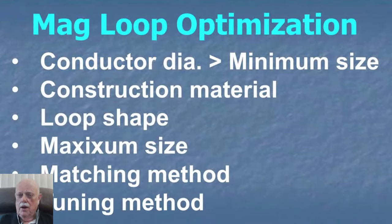Factor number one is conductor diameter, which also leads to the minimum size you should make the loop. If you get nothing but this one section of this presentation when you go to build or buy a magnetic loop, you're going to have your hands on the most important factor — bar none. Let's take a four-foot square loop and make it out of three different diameters: number 10 wire, which a novice builder might stick inside PVC framework; RG-8, which is commonly recommended because of that heavy braid on the outside; and two-inch pipe.